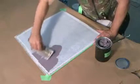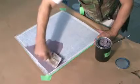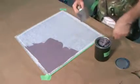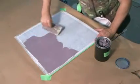Our Venetian plaster is an acrylic blend and is available in any color. This plaster is thick and contains special additives to ensure a high polish sheen. The application begins with a skim coat using a trowel, broad knife, or spatula.